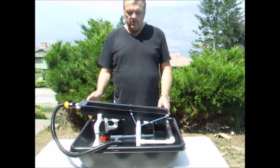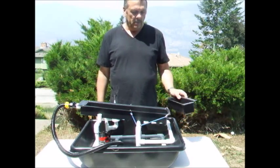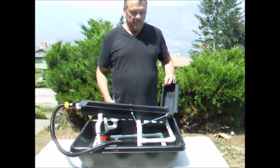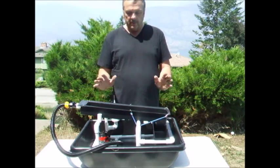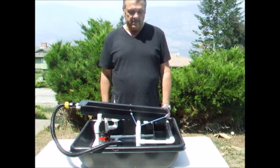I strongly suggest that if you do go with the stand system, you purchase an optional tailings box. Then you can just switch them — as one fills up you pull it out and exchange it with another, depending on how much concentrates you have. Once you've done that, you screen it, get out whatever gold you can, and then run the rest through the table. As you can see, it only takes a minute to set up the table.